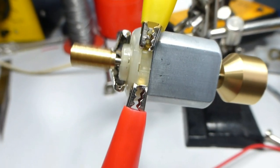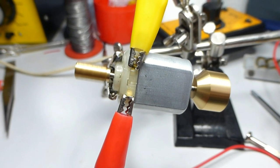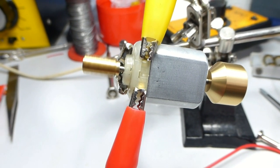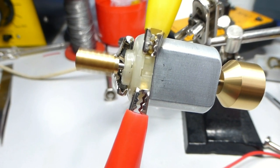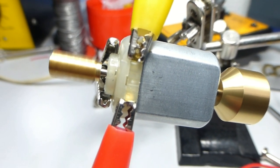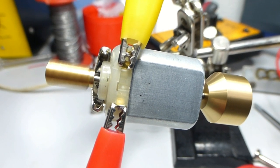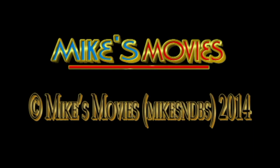This is the original P2 motor fitted by Hornby. I've got it on a static test, as you can see, offload. It seems to start turning at about 4 volts and jumps into life — the problem we know. But also, as it's running, you can hear it varying in speed quite considerably, slowing down all of a sudden — and there it goes, and there it comes back up again.